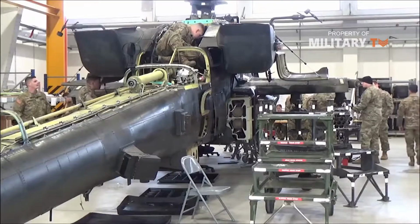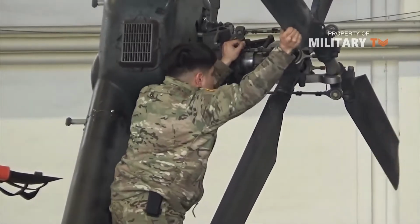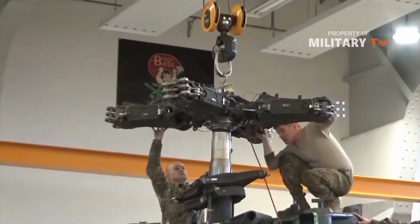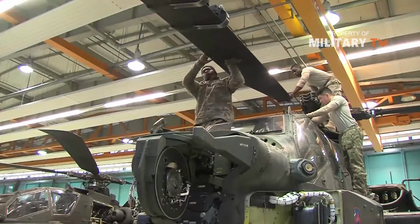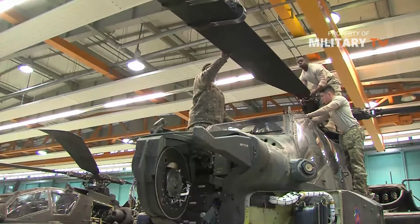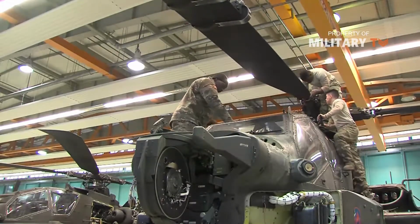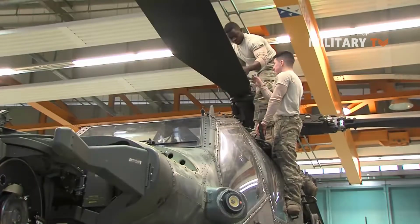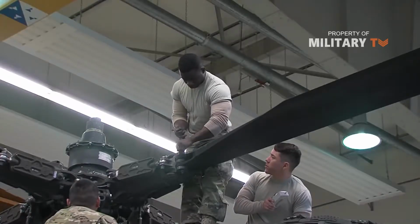The rotor is optimized to provide much greater agility than you find in a typical helicopter. The core structure of each blade consists of 5 stainless steel arms, called spars, which are surrounded by a fiberglass skeleton. The trailing edge of each blade is covered with a sturdy graphite composite material, while the leading edge is made of titanium. The titanium is strong enough to withstand brushes with trees and other minor obstacles, which is helpful in the nap of the earth flying, zipping along just above the contours of the ground.